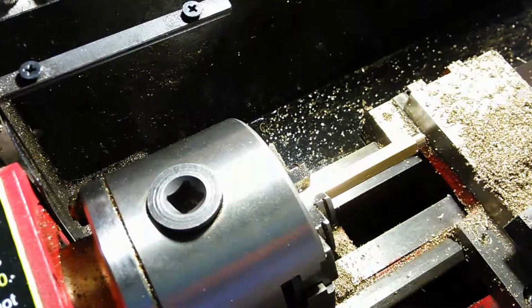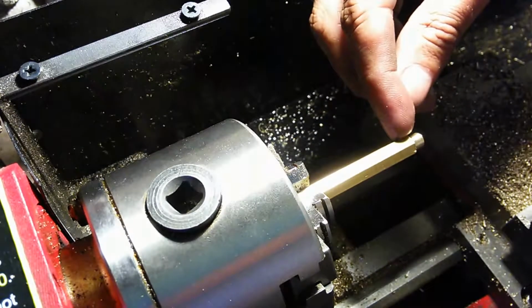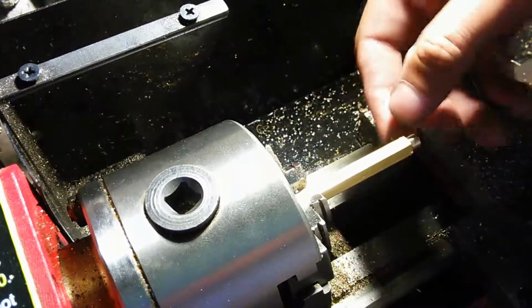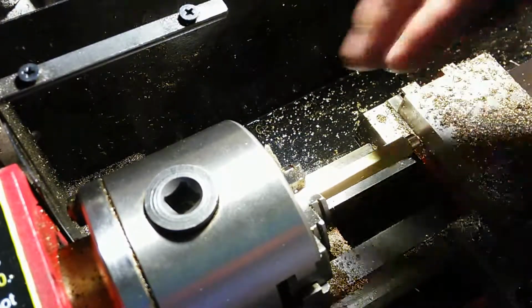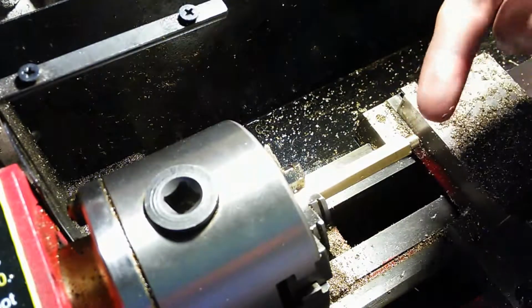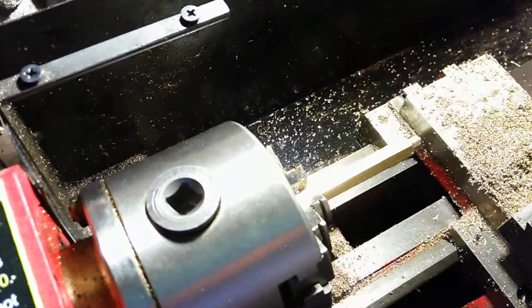So now, since I've cut these shanks, I'm going to cut the top of this with the bandsaw longer than it needs to be, so that this has a shoulder. Then I'm going to flat cut it across just like I did on the bottom of these, to give me a nice flat edge. The final operation is drilling into this end so I have a hole to go into. Since it is a gas orifice, it's got to flow gas.